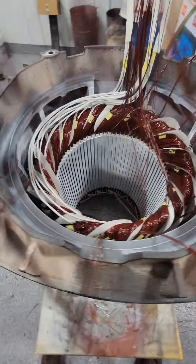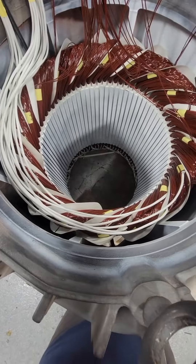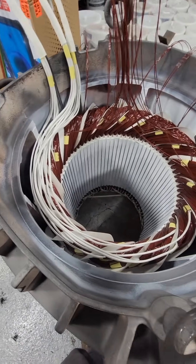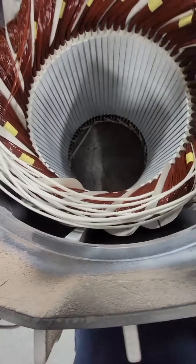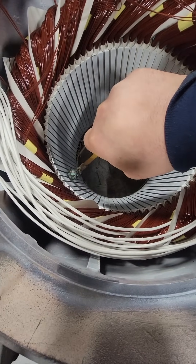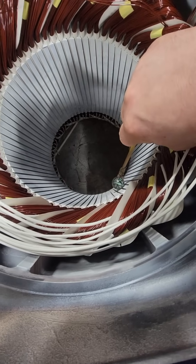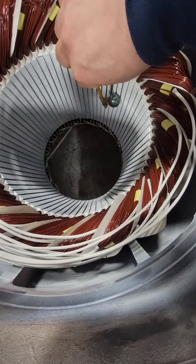Remember that this is basically going to be split into two halves, so we have one half of our connection done — this is one half of our part winding start. To show you how this works, we'll take a 9-volt battery and connect it to two of the three leads coming off that part winding. If we run a compass through this, you can see our north and south poles all the way across this half of the stator. When we get to the other side where I haven't made these connections yet, we have nothing because we have no circuit over there. This is going to be treated as two totally separate circuits.